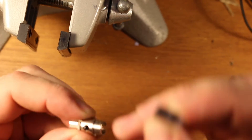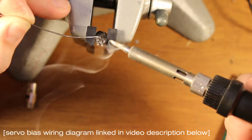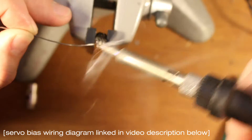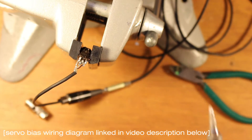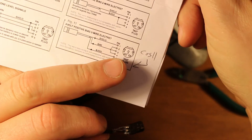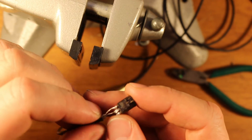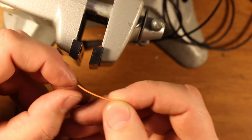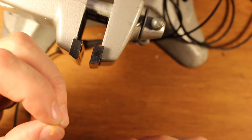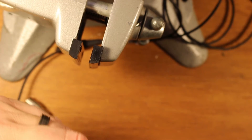We're at the final stages. I'm going to pop out the plastic insert that goes in the center and just put a tiny little dab of solder on each one — nothing too blobby, just enough. We're not working with very thick wires here, so less is probably more to start. I've soldered the black cable the same way I did with the white and the shield, and that leaves two pins open right now. Pins two and four are jumped together, so we're going to create a small piece of wire that literally just connects one and loops back into the other pin.